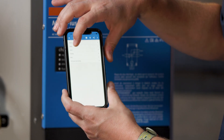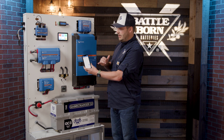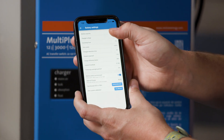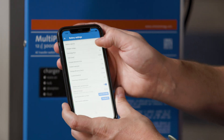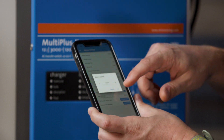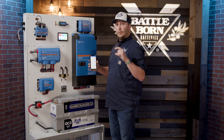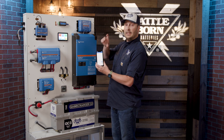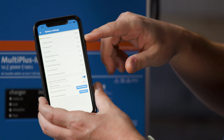Click on battery to see all the settings you need to enter — this is one of the only things we can't program out of the box, so once everything is installed you'll need to throw in these numbers. The first one is the amp hours of your battery bank; I have this set to 270 amp hours for our GC3. Just click on it, change the parameter, and hit okay. The second setting is charge voltage — we usually set this at 14.2 volts. That's where our battery starts to balance the cells, so getting above that level ensures a nice balance across the entire battery bank.